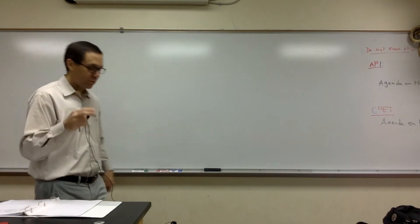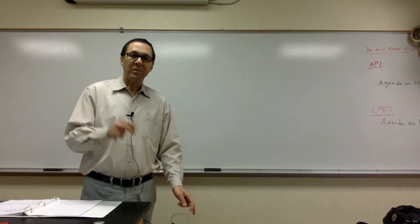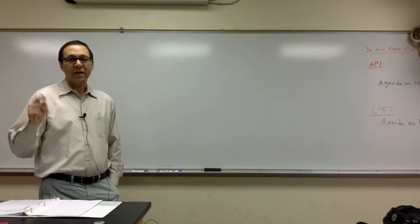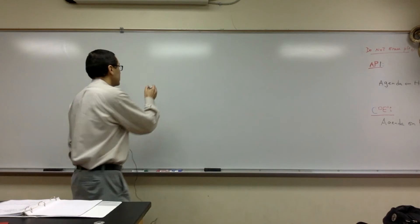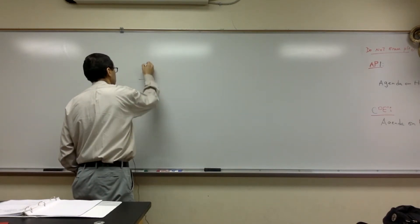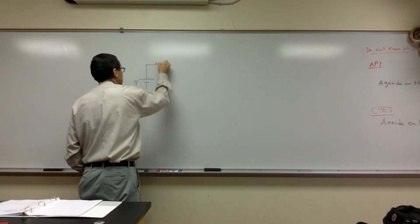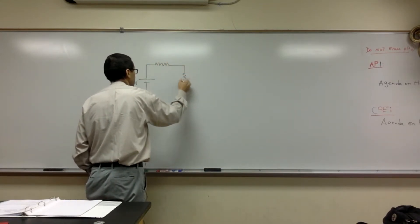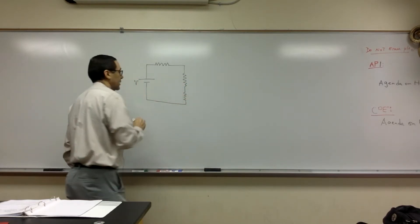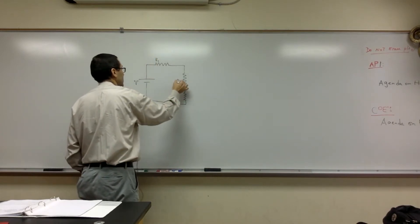There are two things we're going to do here. We're going to do series circuits, meaning when the resistors are one after the other and there is only one path for the current to flow. So here's my battery — that's my voltage source. I'll have a resistor here, maybe a resistor here, and maybe a resistor here. I'm going to call this R1, R2, and R3.